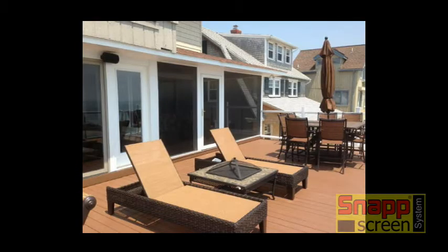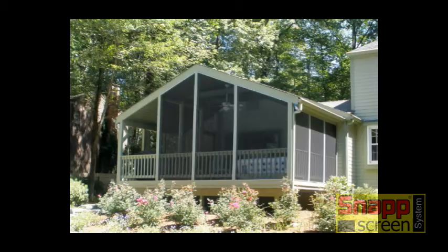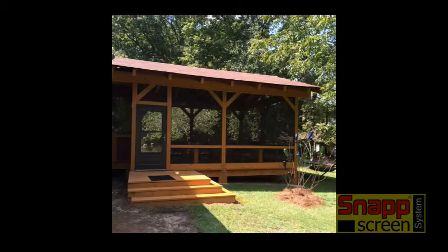We've already covered squares and rectangles in prior videos. In this video we're going to get into what we call the odd shapes — trapezoids or openings that have less than four or more than four sides. We're going to go back to our mock porch opening and set up with a five and then a six-sided frame. The main point is going to be how to do the actual angles themselves and to set up the snap extrusions within those openings. Once you see it demonstrated on both openings, it's pretty much the same theory no matter how many sides are involved, and you should find it pretty simple.